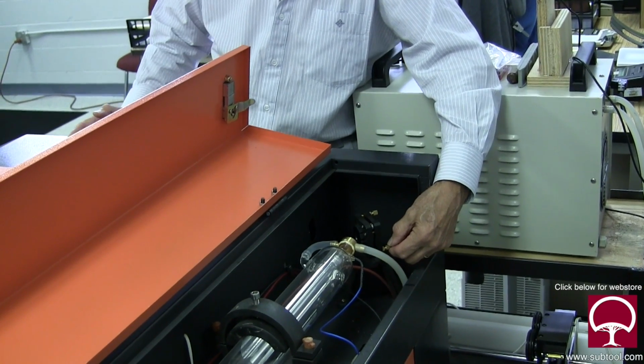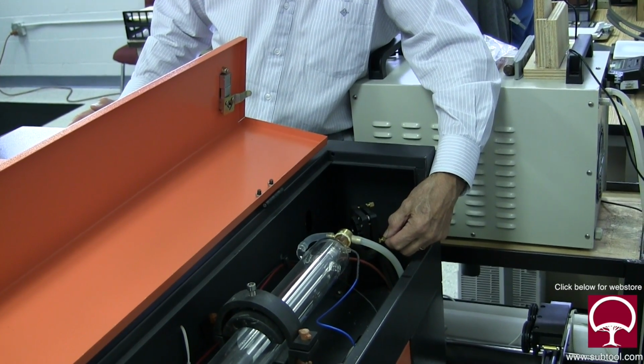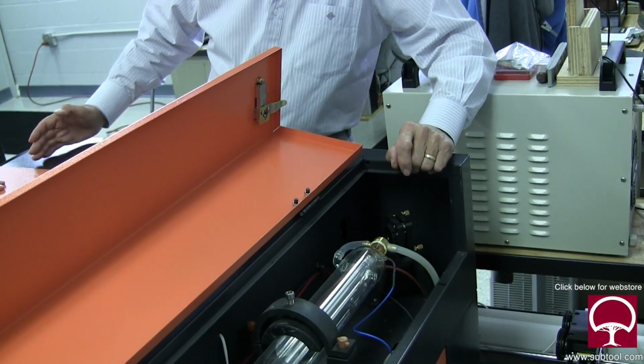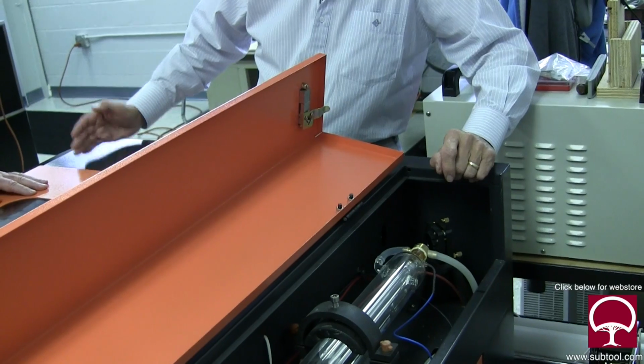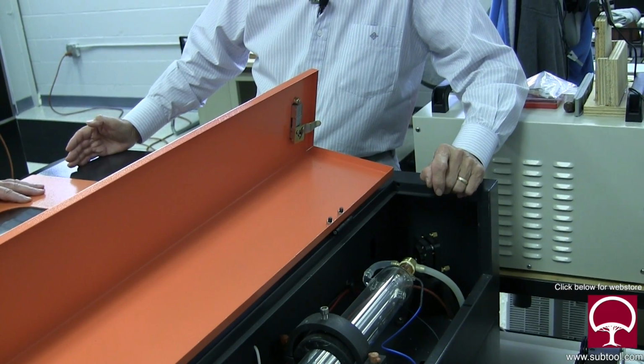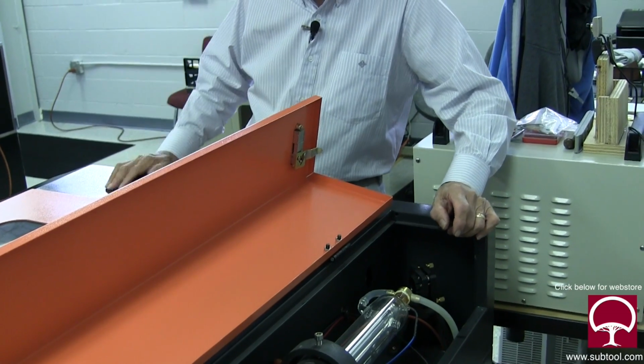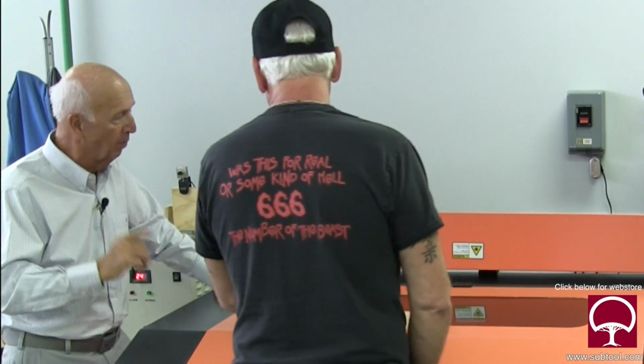And then we moved it out about 6 inches and got another beam, made sure that it was there, got it on center, moved it out till we finally got it. We got the carriage to the front. Once we got it to the front, we got a good beam there. Now we're ready to make the last mirror adjustment, which is a challenge. Well, actually second to last.